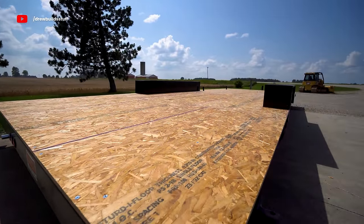These panels I'm nailing quite a bit looser than the trim, and they should be easily able to play up and down. I'd generally start nailing up at the top, and I would just push it right up to the top of the J trim and then drop it about an 1/8 inch, and then put my first nail right at the top of that first full nailing slot. All the rest of the nails along the panel are in the center of each nailing slot and about 16 inches apart.